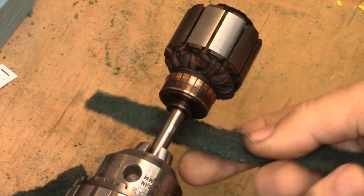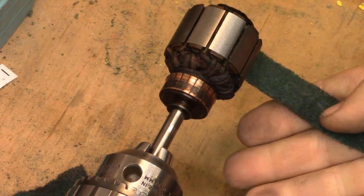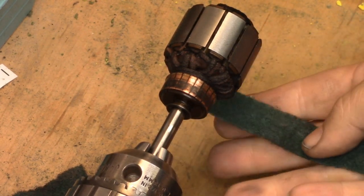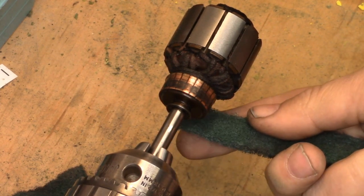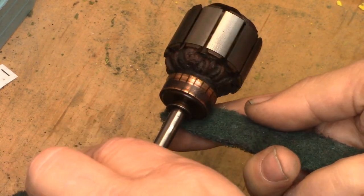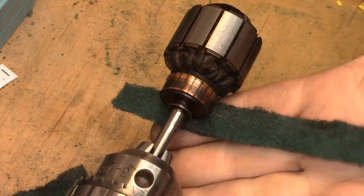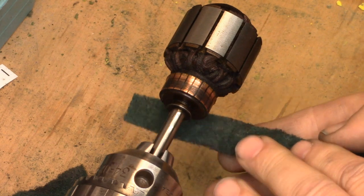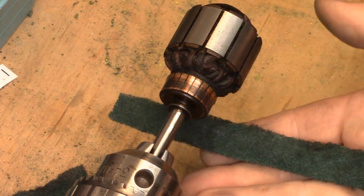What I'm going to use to start the cleaning process is a strip of Scotch-Brite. Now, if you've ever done any woodturning — like making pens or balls or whatnot — you would know that if you're going to be sanding something that's rotating like this, you would do it from the bottom. You see how the direction of rotation would carry that. And you don't grip the paper; in this case we're not going to grip the Scotch-Brite either.